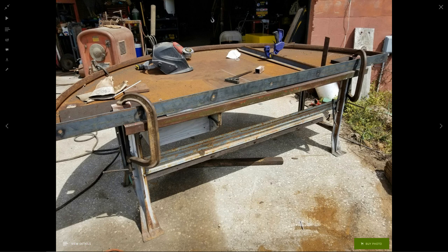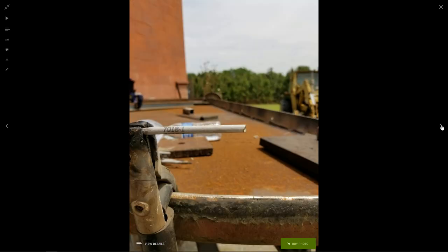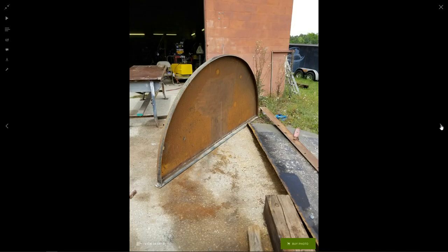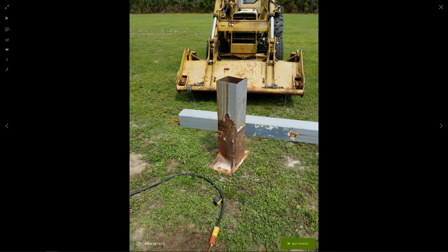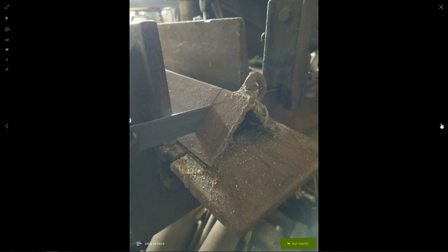You can see my half-inch holes here — this is where the bolts are going to go in and hold it to the wall. You can see my welds going down where I'm welding that flange on. So now I've got the flange welded and I've basically got it sitting down on the floor for the very first time — you see the little edges I have to clean up. This is the first point where it really starts to look like a table. It's actually pretty flat, square, and uniform. The one I'm working on now is god-awful in hindsight — I probably shouldn't have even started with it. Here's a piece of square tubing cut as a pedestal with the saws-all, so I can get it in the shop and put it in the Johnson bandsaw to clean it up and get a square top on it.